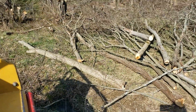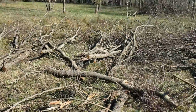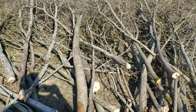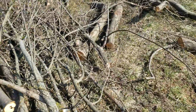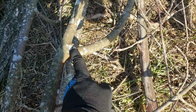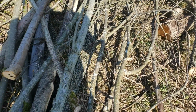So, recommendations. Get a bunch of your sticks laid out, bottom side facing the machine so you can feed them in. So I got a bunch of these laid out. Other recommendations after operating this: it can handle up to a 6-inch log. Even something so small as this, if it has a 90-degree bend off, that counts as the width. It can get hung up on that. Then you got to kind of force it through or reverse it.